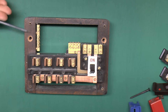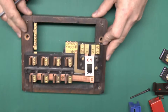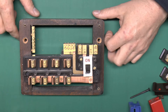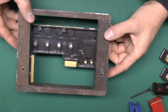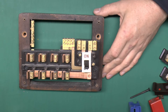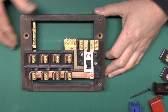The actual box itself is made of wood, and fairly well constructed with joints on the corners. The later ones went to plastic with a wholly moulded piece, and these won't actually be permitted from next year as the change comes in where any electrical enclosure has to be made of a non-combustible material. Timber is fairly combustible, although it's not actually that likely that it's going to set on fire, but obviously it's a possible risk. That change is coming in for 2015, so if you're watching after then, it's probably already in operation.